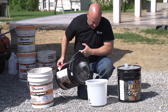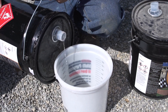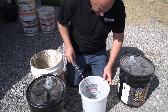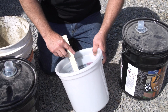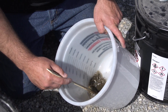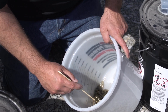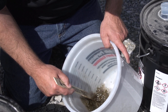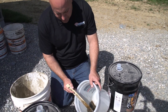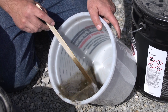First thing I'm going to do is just put a little bit of xylene in — we don't need that much because it's not that big of an area. Now, in order to get the right amount of release, I'm just going to take a normal paint stick and put just a tiny bit in there. I'm going to tilt the bucket a little bit and stir it. When you're doing something like this, you can always make it darker — never start by putting a whole bunch in at once because it's always easier to add a little bit more. That solvent is breaking down the release and putting it into a liquid form. To see how my color is going to look on the actual slab, what I like to do is actually splash it on the side of this clear bucket, and I can look and see how opaque it's going to be by how much of the bucket I can see through it.